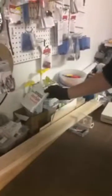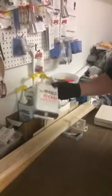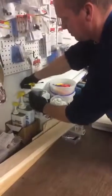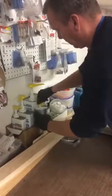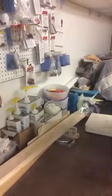Another thing that we did is I started out using the 209 hardener. It was too slow, and it really had a bigger shrink rate to it. These tubes, after they fully cured, were really strong, but they would shrink to the point where they were never fun. So now we're using 206 hardener, just a 206 with a 105. I've really liked this. So we're just going to do 2 or 3 pumps for what we're going to do tonight, and that should be enough. So just 3 pumps, get that going.